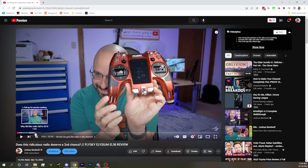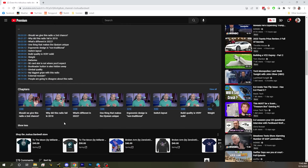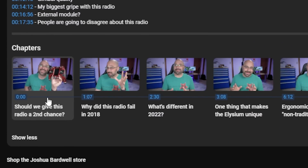The problem with this quadcopter is that they shipped it with ExpressLRS 2.5, and most people have moved their ExpressLRS gear to 3.whatever, because 3.whatever has been out for a while — and you can't bind between ExpressLRS major versions. It simply can't be done. First, I want to show you how to bind this if you do have ExpressLRS 2.x for some reason. There is a way to bind ExpressLRS without flashing it. Most people flash the binding phrase to the receiver, but especially on these little all-in-one boards, sometimes people don't bother. Then I'm going to show you how to get ExpressLRS 3.0 on it. If you want to skip parts, there are chapter markers in the timeline and chapter timestamps in the video description.